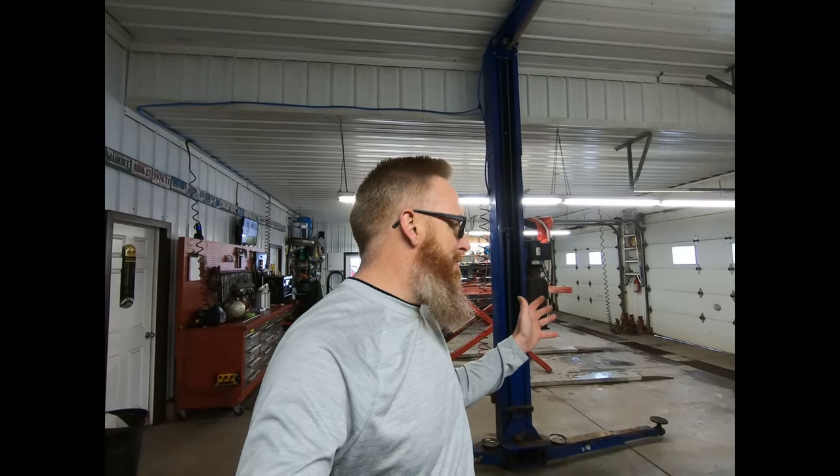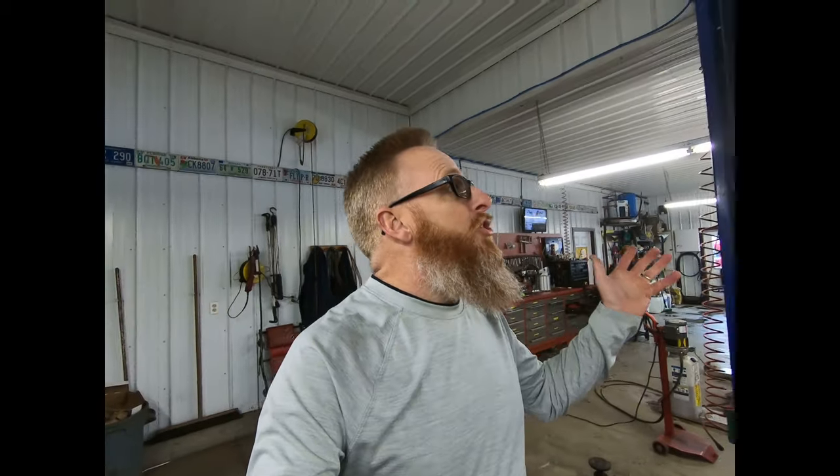As we go over to this blue lift, we put this in and had it installed just as we were building the new shop. We knew we were going to build this shop with a hoist, so we had this bay set at 12 feet in the trusses — knowing that we only had enough space for one hoist. We said, well, we're only going to do the 12 foot in this section and keep the rest of the building ceiling at 10 feet. One thing you've got to remember when you're building a shop for yourself or a business is you've got to heat it in the winter. Here in southern New Brunswick, we have roughly five to six months of winter and most of that is extremely cold. We use oil to heat out here and one of those mini splits out front to heat out there.